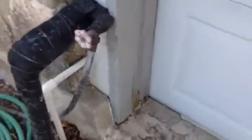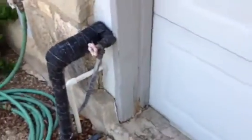We got a little apron here over the garage. Garage door frames in pretty rough shape here, both sides. Pretty rotten, so that needs to be cut out, replaced with lumber, and then we'll retrim that in a Hardie plank. Have some rot right there you can see, so it's for the age, they've been in the home 30 years.